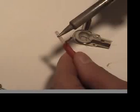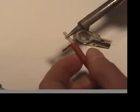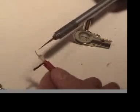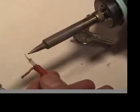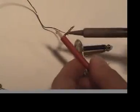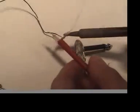I'm using my soldering iron to melt the core insulation instead of scoring it, because scoring is a recipe for disaster — if you score the wire inside, that can break with time very easily. So I'm just using my soldering iron to cut through and get the insulation down. Then I take a little solder and coat my exposed wires — the ground, the shield wire, and the core wire — with solder, so that it's easier to solder onto the jack.